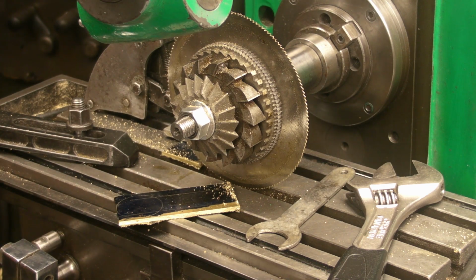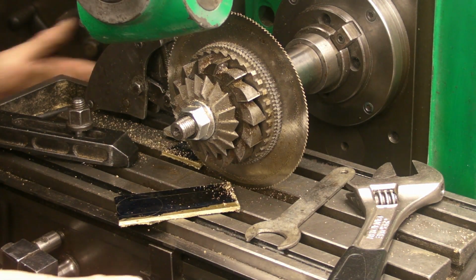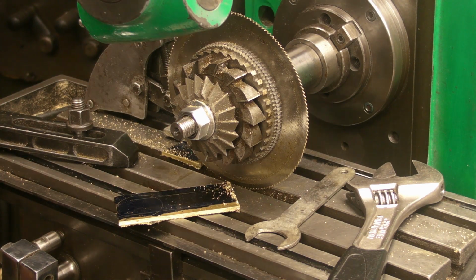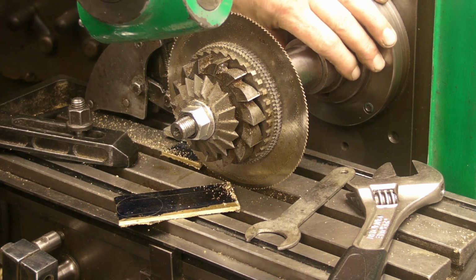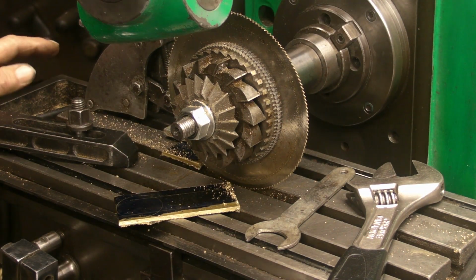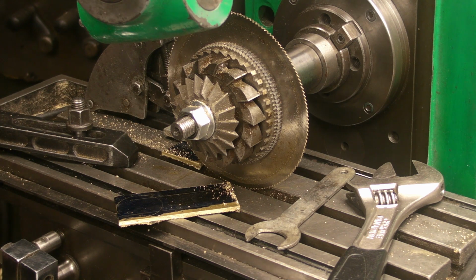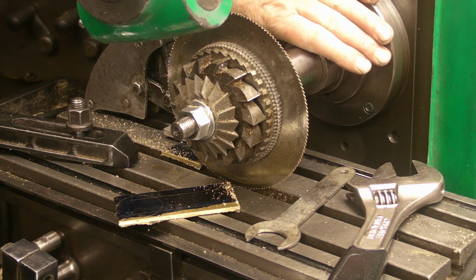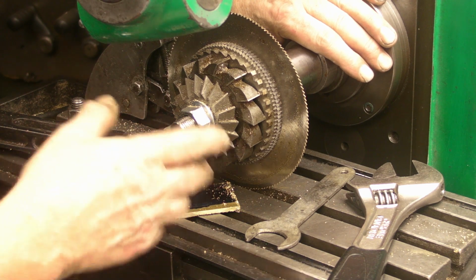I struggle sometimes when I put the dividing head on because there's only half of the support on the table. There's maybe 14 inches of travel on it. The arbor that came with it has an International 40 taper, but I don't think it's the original one to the machine, and it sticks out about this far. What I've done is cut it in half, and half of it I use in an ER40 collet with an International 40 taper for the machine, and that's the original one.